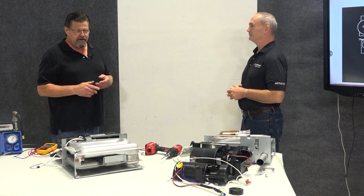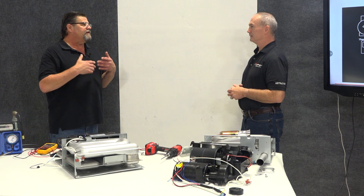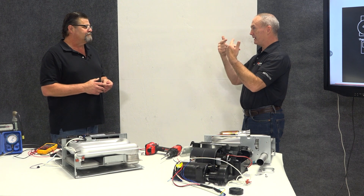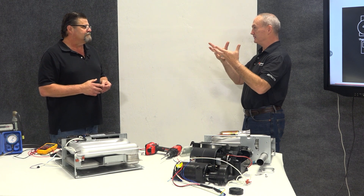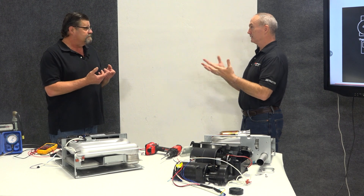If it overheats, the limit switch turns off the furnace. Then what happens is a short cycle — you get about five minutes for the airflow to run before it's listening for the limit switch to turn back on, for that circuit to close. When it cools off it resets and it'll go to fire again. The limit switch is a bimetallic piece of metal that makes contact and gives continuity, but when it gets hot it pops — the two different metals cause it to separate and break the circuit.